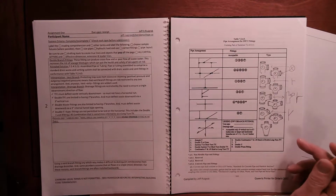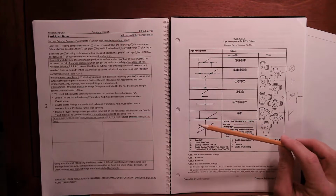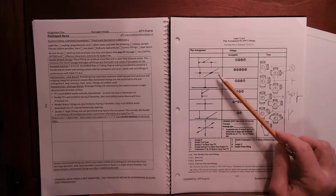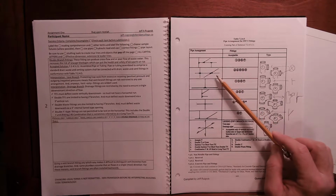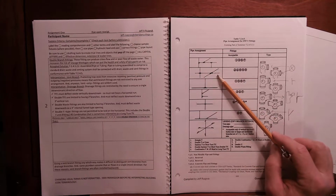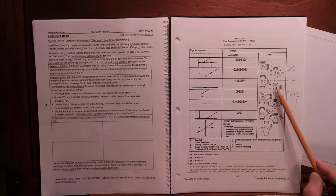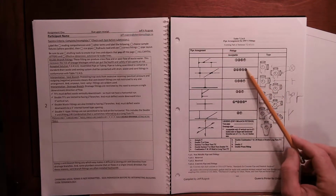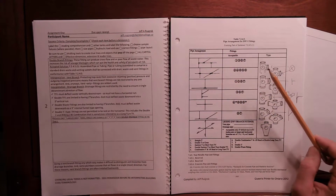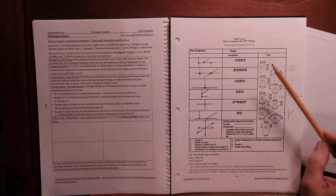What we're not going to focus on is the rest of these, but I will give you a quick tour. If you look at these drawings, remember you're going to be doing drawings for me, so you have to understand how this works. This is all vent piping, and it includes all fittings 1 through 9. So you can use all these branch fittings in a vent without reservation. Go ahead, have fun. They've even got them going every which way.